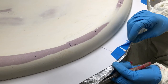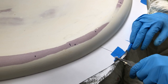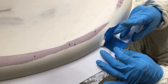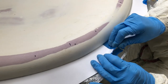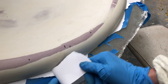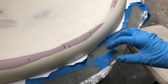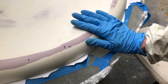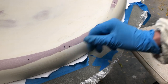I've finished the top side of the mold and flipped it over. Now I'm going to remove my paper parting line — that circle of blue — and then seal the bottom half. I do have a slight overhang on the parting line here, but after I finish this side of the mold, I will cut so that everything is smooth and even. That's not something I'm concerned about right now.